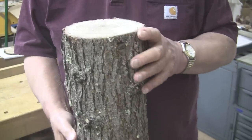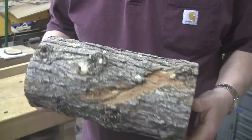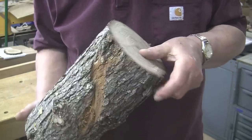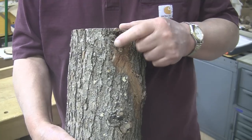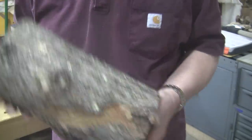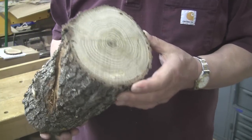It's going to be a big round bulbous shape at the top and a nice smooth long taper to the bottom. Maybe we'll have a bead around the top opening. You can see there's a chainsaw whoopsie right here. I had intended that to be the bottom and this to be the top, so as I'm turning I'll turn all that away. I'll find the center of each end and put it between centers on the lathe to get to turning this white oak vase from Dennis.